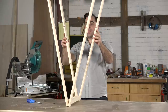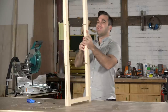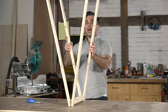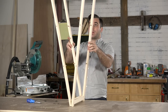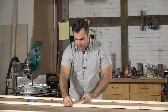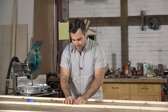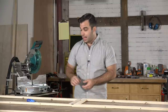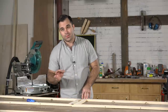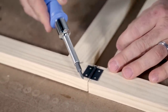I've given these a quick sanding. This is how it's going to look upside down — I've installed the oak dowels into the holes and quickly sanded the whole thing. We're going to open it up and add the hinges. I'm going to line these up perfectly. I have these little one-inch hinges that are going to be mounted right at the crack. I'm going to use a screwdriver to install these so I don't strip them out — they're tiny screws. You just want to make sure the barrel is aligned with your gap.